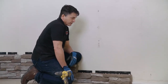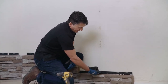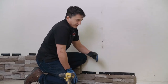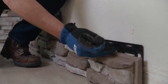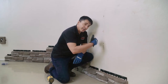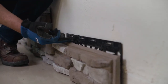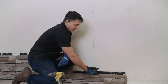Next we're going to put screws into the rail. Install the concrete anchors in the designated area — there's a line right on the rail and a little area that says 'anchors below this line.' There are also some small holes, but sometimes people get confused and want to put anchors in the slot — that's not where the anchors go. Make sure you put your concrete anchors into the hole below that line on the rail.